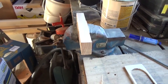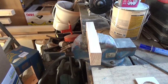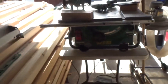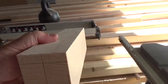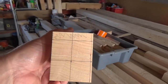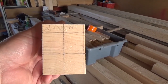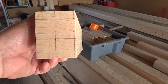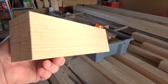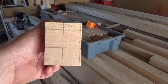What I'm working towards is making a spar, or a mock-up of a spar. I need to make two spars — both the front and the rear. I've got the first one out here, that's just the cap. I used the jointer to get the left-hand side square, and I want to plane the right-hand side as well as the top and the bottom. The top and the bottom are both at angles — different angles — so that's going to be a bit more of a challenge. It's not a huge piece of timber, but it's got some nice grain on it and I should be able to get a spar out of it.